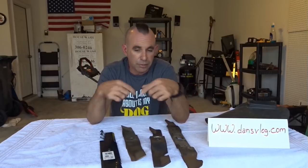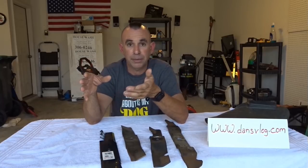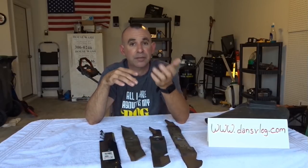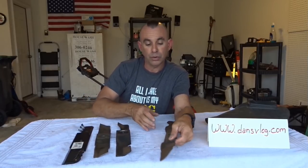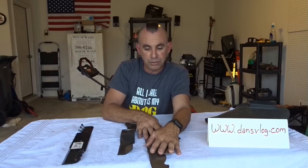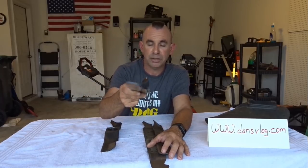In the next video I'll show you how I side discharge — how I direct my clippings, how I clear an area, and how I avoid dealing with excessive clippings while mowing at the same time. This video was just to explain all the lingo. To summarize: generic three-in-one blade — don't expect too much; high lift — great for bagging and side discharge; gator blades — great for mulching, don't expect much from side discharge or bagging.